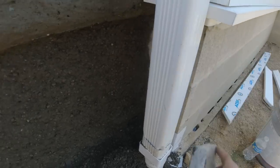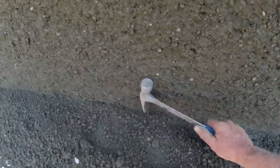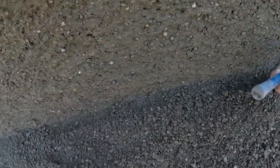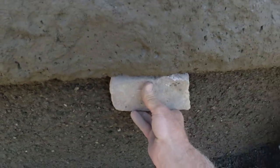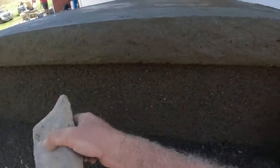They're doing stone under here — they should do stone under here so it matches. I didn't hold this form back far enough. So while the concrete's still wet, talking with the homeowner — yes, they do want stone here. This is the stone they're using, so we just took our claw hammers. The concrete's pretty tight but still scratchable. I just like posting everything, even when we have little mishaps — everybody has them. So now the stone will fit up underneath there rather than like that and look crummy. It only took 15 minutes.